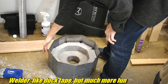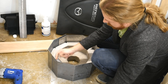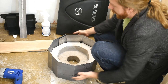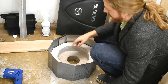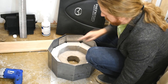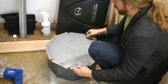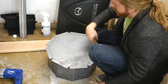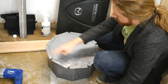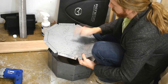Now I just need a welder. These are going to be bent down slightly — like an inch and a half — so they'll cover most of this and hold all these bricks up from the bottom. The wrapping method will hold these bricks together nice and tight. Plus they'll be held up so that none of it will want to fall apart. Which means I need the top piece. Ta-da! Already did it. This piece of metal looks really gross. I put that on top of this, traced everything out, traced the hole out. These flanges are like one inch. Bend all those up, then weld it to the other side. Time to drill this hole.